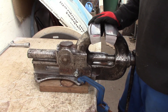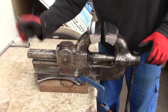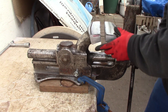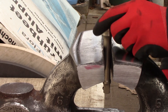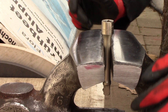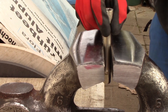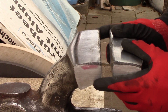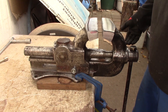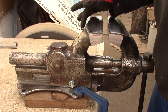The last one is the most complicated repair. This is repairing the dynamic jaw, the slide and the dynamic jaw, by either welding it up or putting a shim on it. I welded this up and I'm going to show you how I did that - you now have just minimal wiggle. If you clamp something in it's not moving upwards like on the other repairs, because you actually repair the slide so it's not moving. There's still a little bit of wiggle and I'll explain why. But this is the perfect repair to do, and you can actually do it by hand without a mill, though it's not easy.